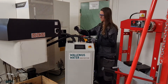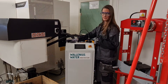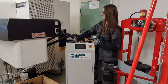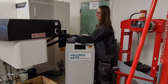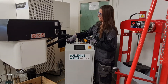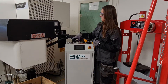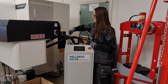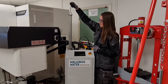Once we've done that, we will open this lid here that goes to the priming tank where the strainer is situated. In this case we have a pretty large difference between the level of the machine tank and the level in Fluid Worker, so a lot of fluid will be drained here. We take out the filter, empty it, clean it, and put it back.